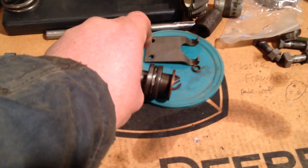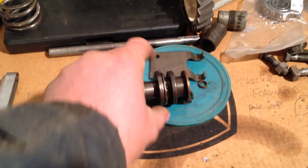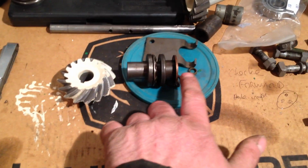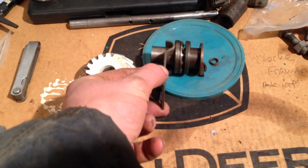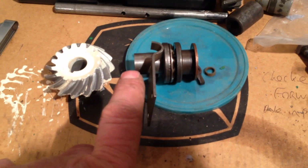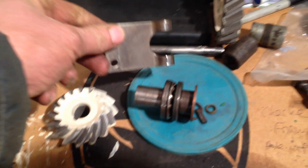There we have the sliding bushing and thrust bearing that runs on the shaft in here, which the weights work on this face. These weights push on this face, which in turn this sits here like so, and that works on the governor lever and effectively works the throttle, this little flappy paddly bit.